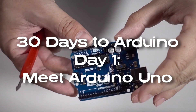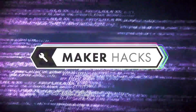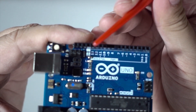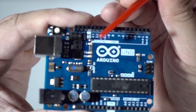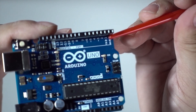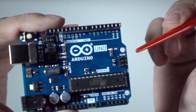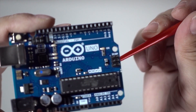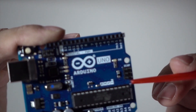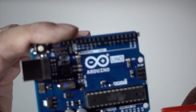Let's have a look at this Arduino Uno and see what it's made up of. Along here we've got digital pins — they're numbered. We've got the serial in and out pins and the ICSP programmer, which is a way of programming the chip when it's on the board to put the bootloader on. The first thing the Arduino does when it starts up is it looks for the bootloader, executes that, which will then launch your program — your sketch or script.